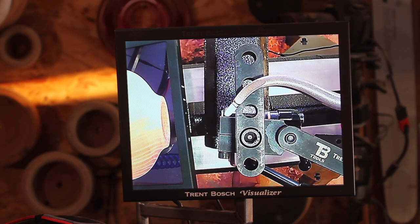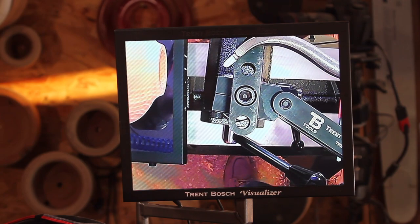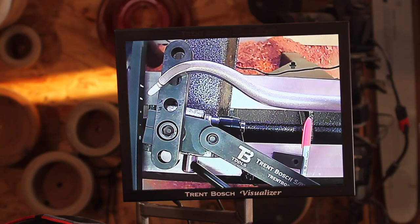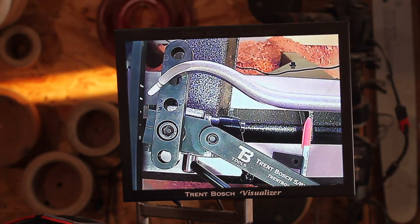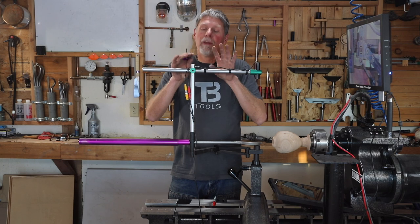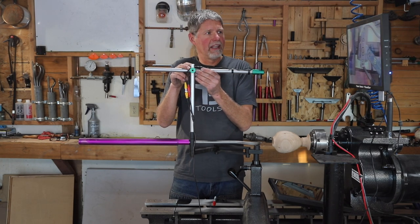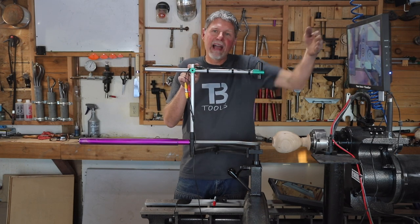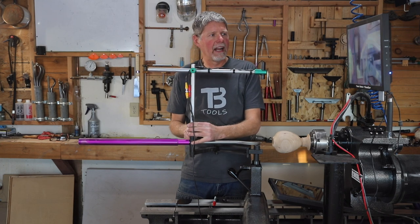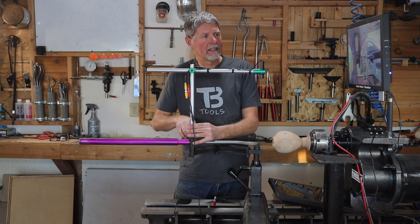Let me move it a little bit so it's not in the center of the screen. If you're way up in a corner or way forward like that, the camera is no longer right over top of the tool. So you want to go ahead and manipulate the bars — there's a horizontal bar that I manipulate, and that will give me the axis that goes back and forth across the screen. Then I manipulate the bottom one and rotate it back and forth in order to get the other axis that we need to set up.